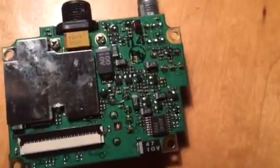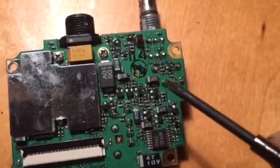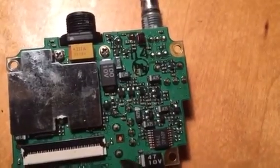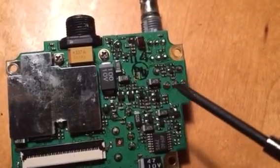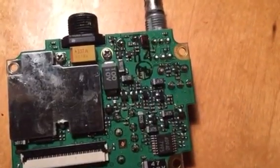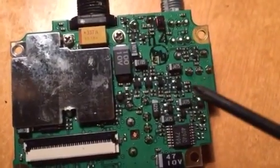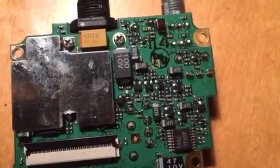There is a mod where you can add an inline capacitor to block DC — it's a 1 microfarad ceramic cap, a mod that somebody's come up with. I might look at doing it, or I might just put this one back together. I'm thinking of selling it to be honest because I've got the VX-8 now, but I want this back and working in full first.